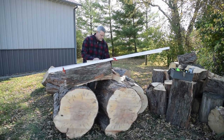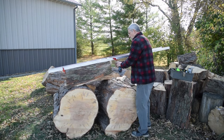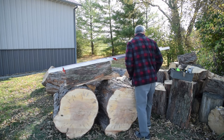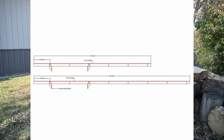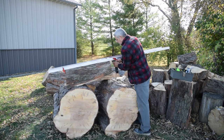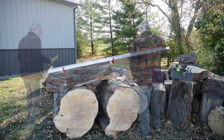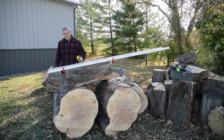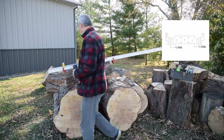Pushing the rail and bracket tight against the log on one end, I use a block of wood cut to fit between the rails on the other end to fill any gaps between the log and the bracket. It is important to note that in mounting the Zosun brackets to the rails, the orientation of the bracket ears are facing outward from one another. By doing so, you are able to swing the bracket back and out of the way in one direction, but at the same time it allows the bracket, when securing to the log, to keep it from moving forward in the opposite direction — thus bottoming the brackets out against the top of the rails, allowing for a secure and tight fastening.